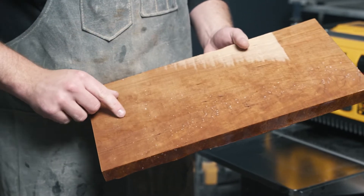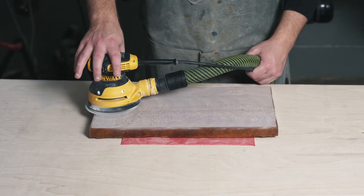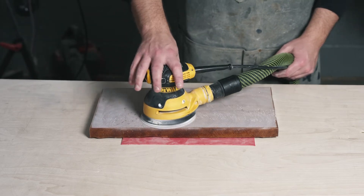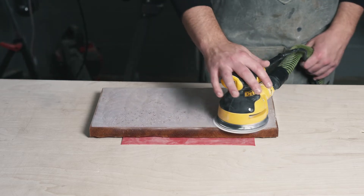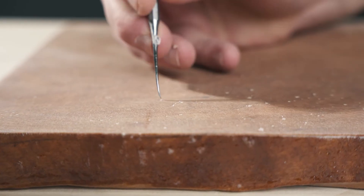But what if you don't have anything to fix? Can you just pour a second coat of epoxy right on top of the first? You still want to make sure that your two layers will bond to each other. To ensure that happens, you'll want to sand your first pour evenly and thoroughly with a 120 grit. Sanding the first layer increases the surface area and ensures a stronger chemical bond between layers.